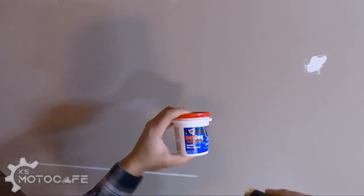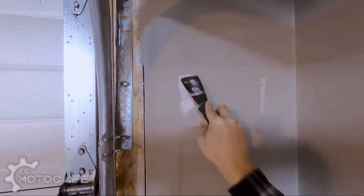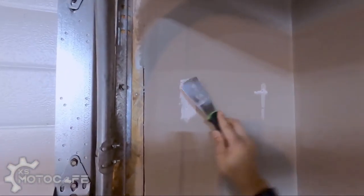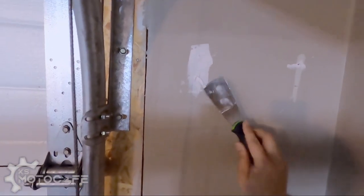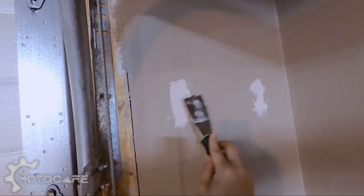I'm using dry-dex which is supposed to patch drywall holes. There are some new holes I didn't cover, so it's just like a putty — you put it in and flatten it out. It's actually quite therapeutic. I know there are probably tradesmen watching who think I'm doing it wrong — unfortunately I didn't have anyone teach me this, but I'm learning. I could probably use a smaller spatula; I'm wasting putty. I like to put a little extra on and then sand it down rather than trying to make it super flat right from the start.